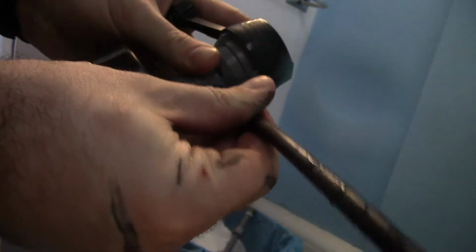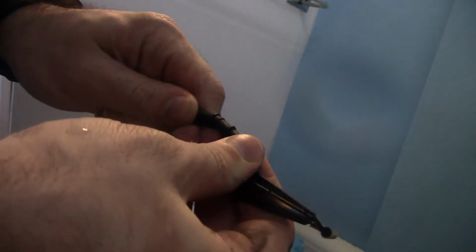Sorry, I can't do this one-handed. Okay. Once you hit the top of the line for the toilet, you have to stop, drop and roll. It's about as good as it's going to get. So one of the things that I'm going to do is bring this the whole way up through this twisty here. Alright, back to the adapters. So this goes on wedge down all the way up. The hose goes on the barb in here. And then the barb clip, or the hose clip, goes here. This is what actually helps prime the toilet.